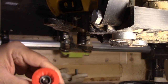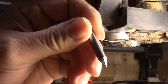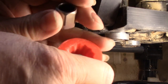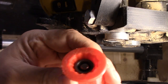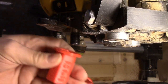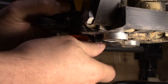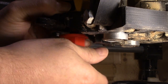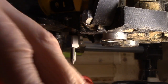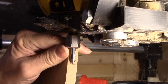As you can see, the whole assembly drops right down in there. I'm going to take this quarter-inch V-bit that I've been using, drop that down inside there, then put the collet nut over the top and slip the collet in. One rolled away on me there — there it is. Now we've got that whole assembly together — assume the position, lock the bit, hold that with my finger on the bottom. As long as you're holding pressure up against it, you'll get to the height you expect. Let's see how close I was just guessing the adjustment — not bad, darn close.